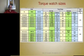To measure the cogging torque, you can use a torque watch. You could buy these, they're a few $100s, and you buy them from Honeywell. It's a very good device to use to actually measure them on a dyno. It's very tough. You need a torque transducer in line, and you've got to rotate this very slowly. But so I think the torque watch is a good method.